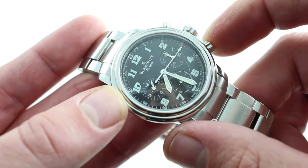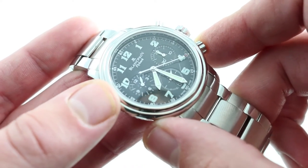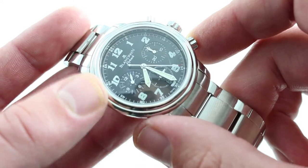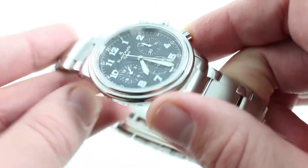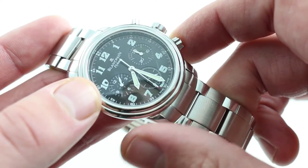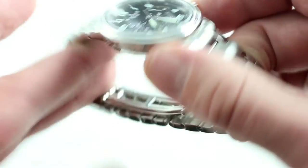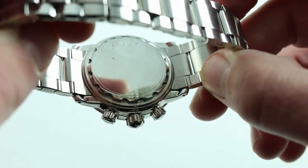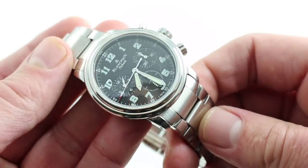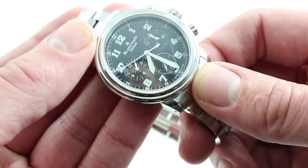Mechanically, it set the pace for the in-house Rolex caliber 4130. The Blancpain flyback movements designed and executed for them by Frédéric Piguet are some of the gems of modern horology, originally launching in the late 1980s. These calibers feature fully integrated automatic winding with a column wheel function selector and a vertical clutch engagement, finished to a standard that quite frankly deserves a display caseback. But thanks to the solid screwed-on caseback, you get all of this plus 100 meter water resistance, so although it's not explicitly a dive watch, it has that kind of hermeticity.